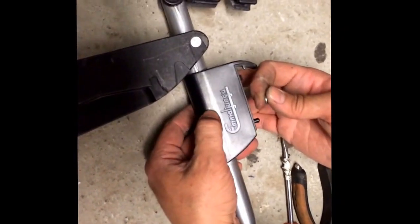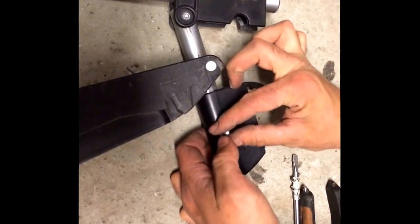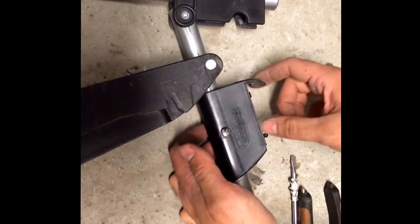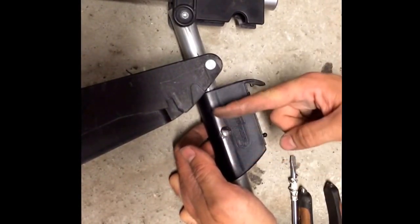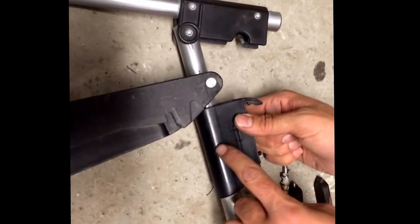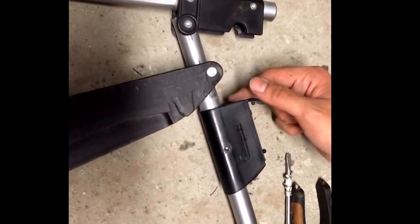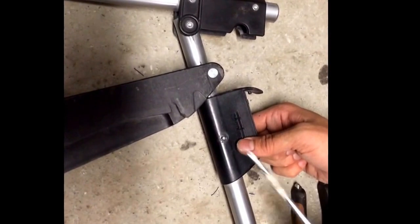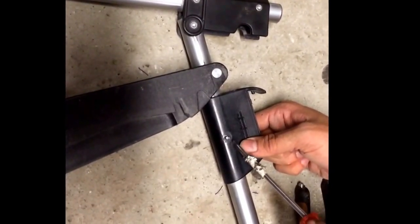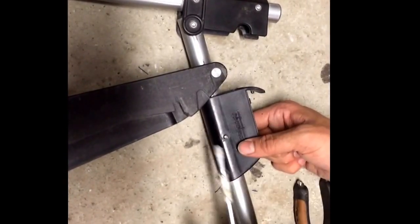After you're done, you can slide this pin back through and put the cap back on. You can more or less just press it, but if you have to, place something flat underneath and use rubber on top to preserve the dome shape and hammer it. This pin is attached to a spring that's also attached to the rivet, and that's what creates the mechanism. Since we're going to have to remove both the rivet and the pin, when putting it back together, we'll need to get the pin and the screw — which replaces the rivet — through either end of the spring.